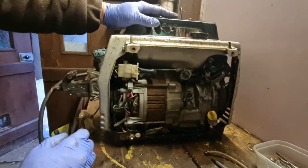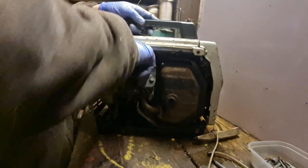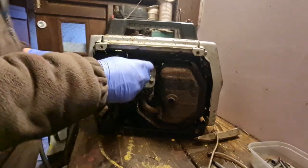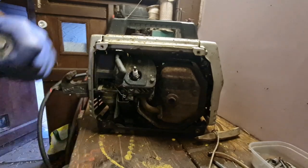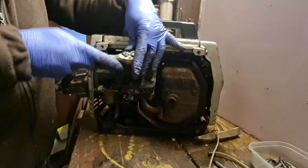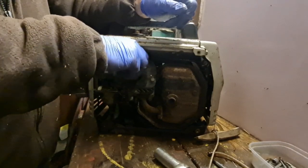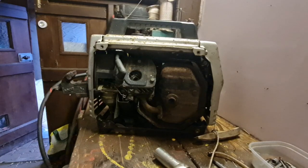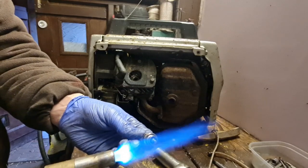Now, we might have a carburetor issue. So we definitely had a spark there, unless where I've put all that oil and stuff in the cylinder that's fouled the plug up. So we haven't got a clean spark plug now, and that's all gummed up. That's possible. Because if that was wet, she wouldn't spark, and then we wouldn't have no run, would we? Heat the old plug up.